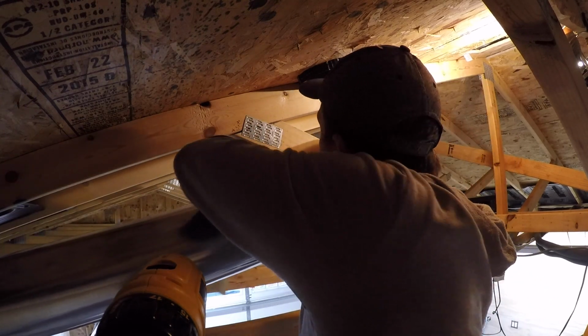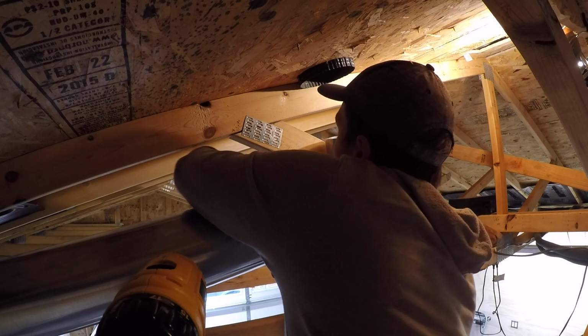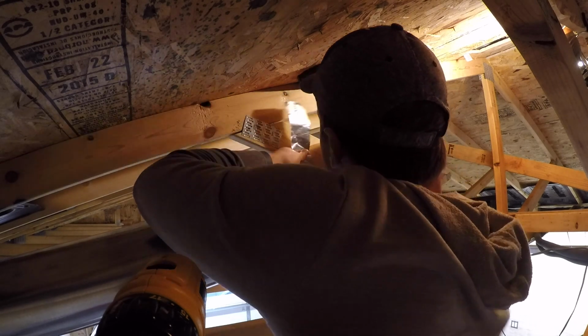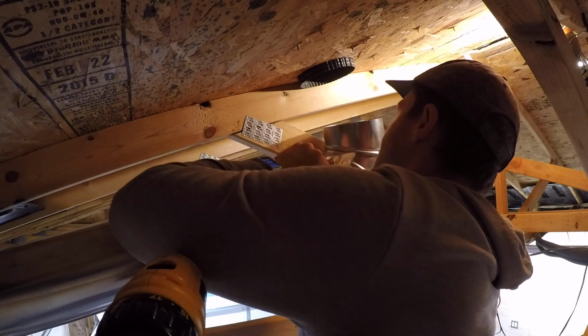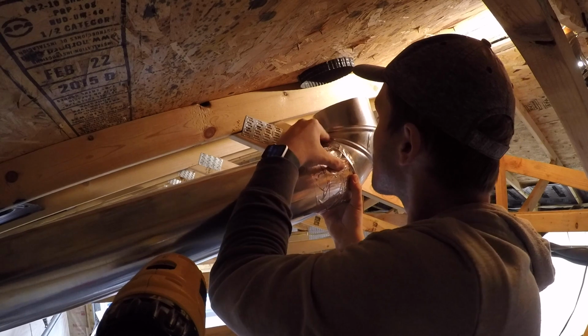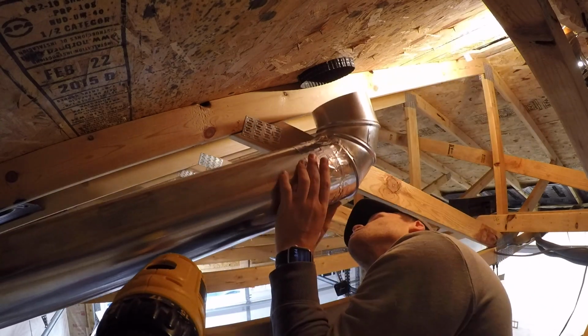Also, I don't know how important this was, but I made sure to get the foil ducting tape that was rated for cold and hot temperatures, since this will be up in my unheated, unconditioned attic, and I don't want the adhesive failing on days where Mother Nature, Minnesota edition, decides we need negative 20 degrees Fahrenheit temperatures.